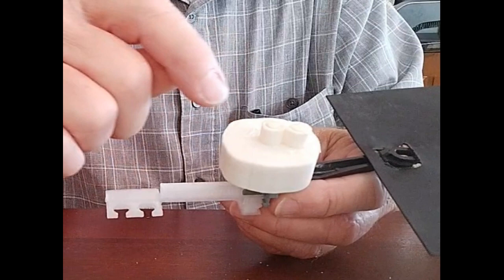My background is in a former career. I was an air conditioning and heating repair installation person for about 20 years. And I've seen a large number of air conditioners that their compressors failed during lengthy high heat days. And this can be avoided. A little system like this, a little mister, can certainly help cut down on compressor failure. It also does lower your head pressure on the condenser coil, which in turn reduces the amperage being drawn by your compressor, therefore using less power.